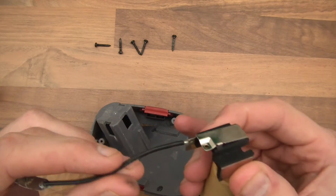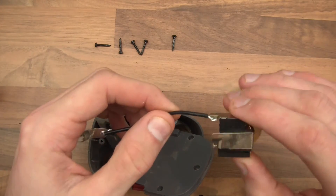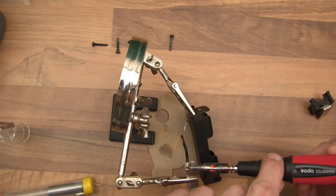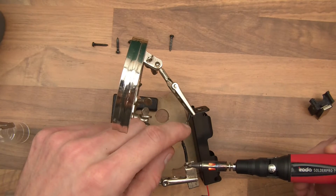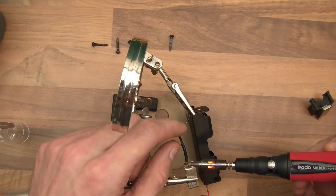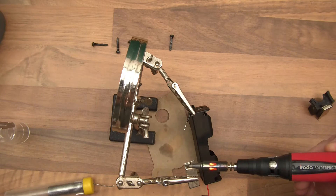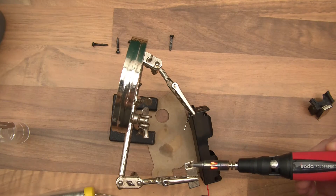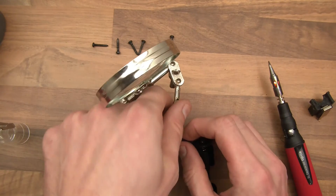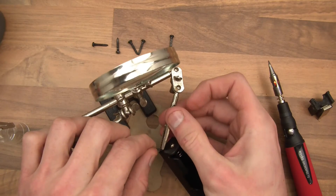We'll start with the cathode piece because that's going to be the easiest piece. It'll probably be easiest to snip that and just re-solder it. So I'll take that off — snip that. I need a bit more heat. It's just going to come off. And there we go, it's off. Now let's try and put it back on. I think I'm going to have to get rid of that solder. Let's see — I don't need that heat shrink any more. I think I'll give it a go, it might just about work.